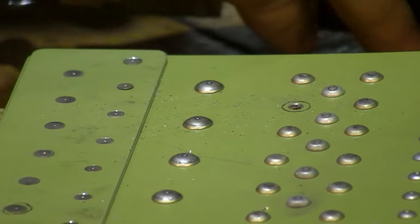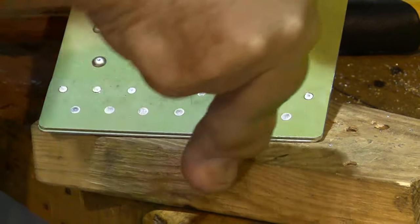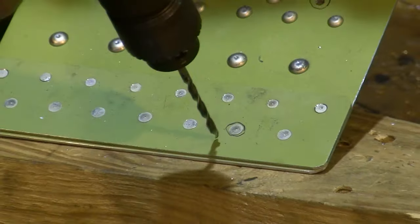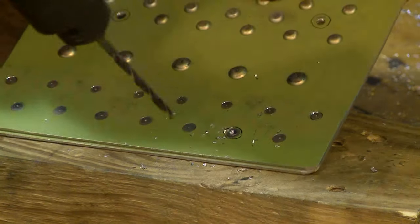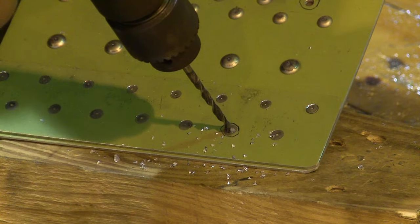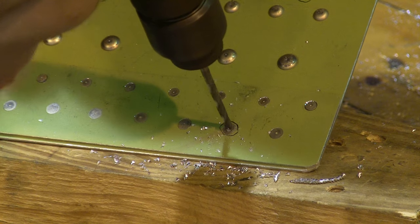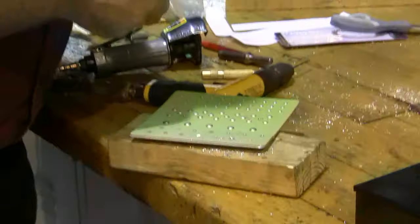The most difficult rivet to remove is the universal flush head rivet. For my flush head rivet, once again, we're going to punch the center, and now we're going to drill down. But it's hard to know where to drill down to, because we've got to drill down to the base of the bevel, but not into the base metal. So, very similar to before, I'm going to begin drilling. I'm going to stop and check to make sure I'm in the center lots of times. I'm going to drill down until I reach the base of the head, but not below. Once I've reached the base of the head, but not below, I'm ready to tip that rivet out.